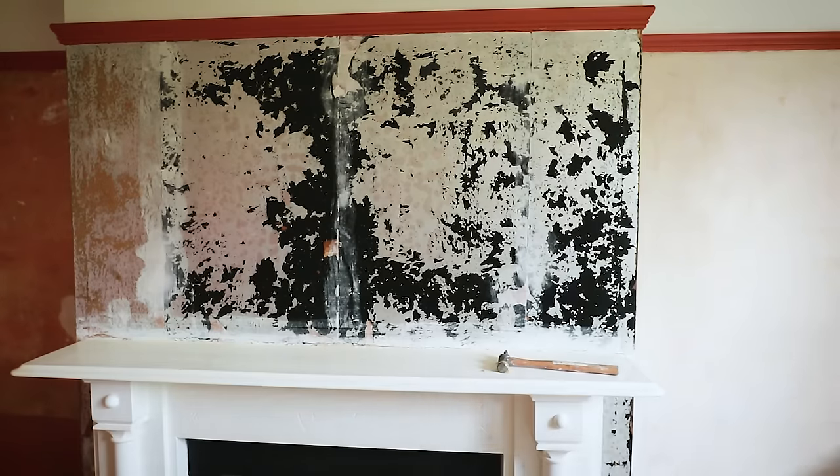We've stripped all the walls - you can see that. That side there had polystyrene insulation on. We stripped that off dead easy, then it was lined over the top and painted. That's come off. My plan - what we've recommended - is to re-foil both sides of the chimney breast, bringing it round onto the front. But technology and products have moved on. We don't use this anymore. The last time we used it was last year and it had changed - it was rubbish.